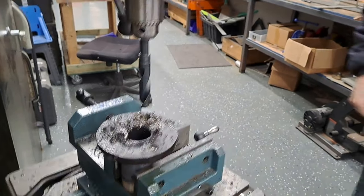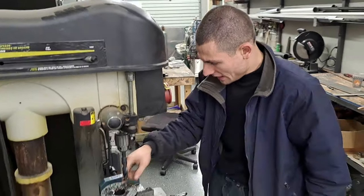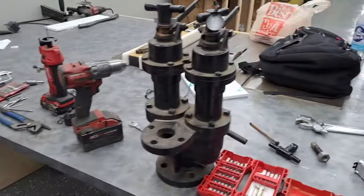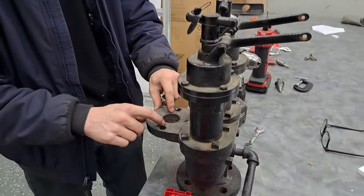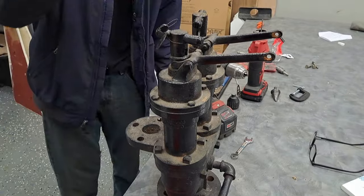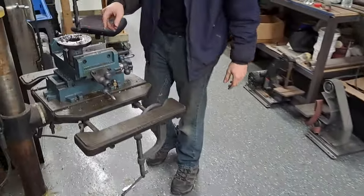Yeah, we got a lot to connect. This is for the main steam turret off that valve. And we've got the safety valve bonded to it, which is right there. It's kind of interesting, the valves are under here. This is the common exhaust for both of these safety valves. Of course, one lifts before the other one. We got to set all that calibrated.